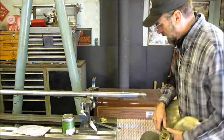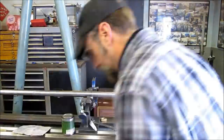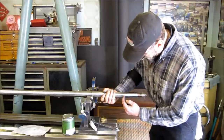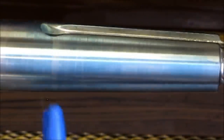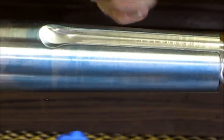Two places you're looking for contact — on the shaft and in the propeller. I'm looking at the shaft here because it shows more than what you got in there. You have your extremely hard hit right up here at the very top, and you have some areas down in here that aren't even being touched. Right in here we're hitting hard all the way around the top. Now we see a little contact area in here — a couple spots, not all the way around. So even just our cleanup on the bore and the shaft, we've already got a better fit than when it was removed.